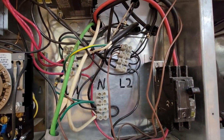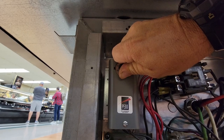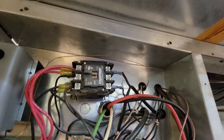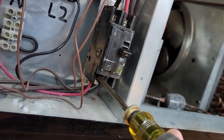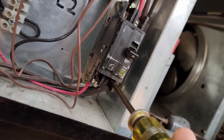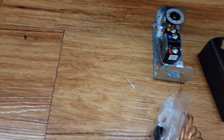Can't do the same thing on the black — not sure how they're breaking that, doesn't make sense. I just don't like that at all. Alright, so we killed the power. Power comes in at the top at 208V. I got like a turn and a half or more out of this breaker on both sides. We're going to go ahead and tighten up some of these connections and change the thermostat.